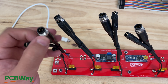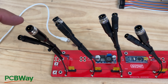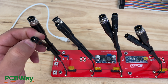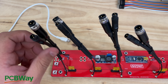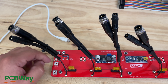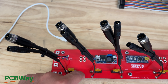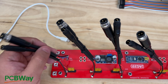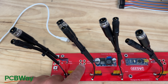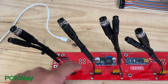The connectors first. This connector is the output connector of the battery pack, so this is the input connector into this board. The smaller one is the charging connector — those are two different circuits in the battery, which is why we separated them. If you look closely at the board, there are three traces, three tracks, and they're separated. They have a common positive rail, so the middle one is the positive.